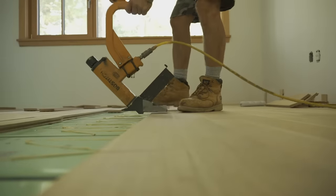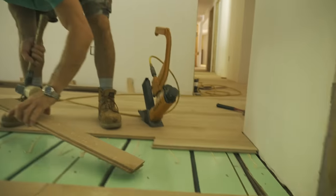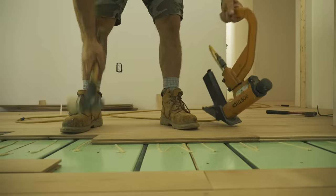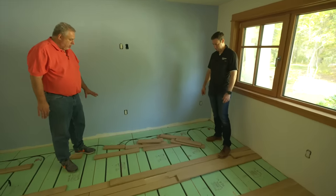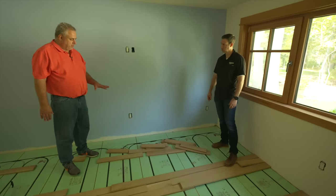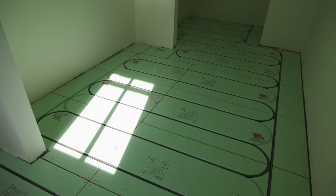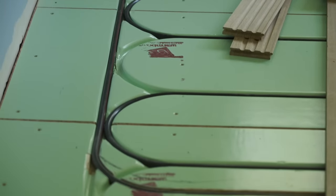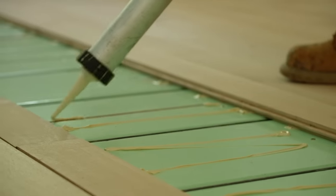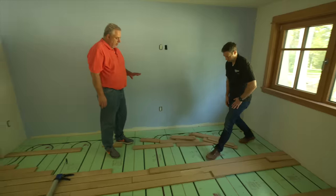This is beautiful. I love a good white oak floor. So this is what we're talking about — this is the radiant heating for the house. My assumption is these black tubes are going to have hot water flowing through them. WarmBoard has two systems: their remodeling system and their structural subfloor system. This is the R system, the remodeling system, because we had a structural subfloor. It's just under three-quarters inch and it has that router groove where these half-inch lines just pop in.